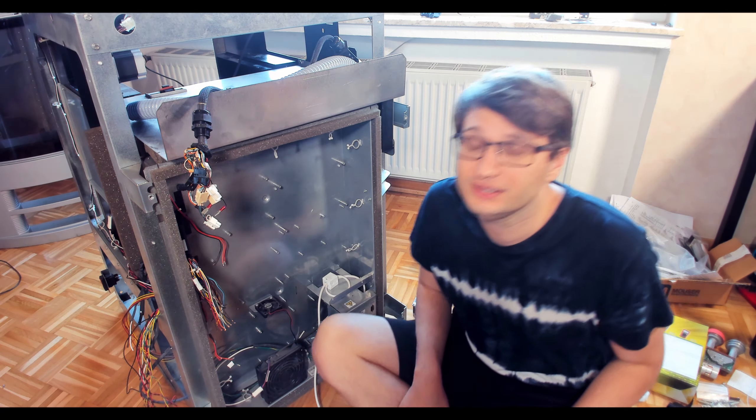The connector kit came with this crimping tool, but the problem is this is clearly not the right tool. Usually with these ribbons of connectors, you would place the connector here on the tool and crimp it without removing it from the ribbon. But this jaw here is too big — if I crimp this way I'm going to be crimping the pin part as well. It should be much narrower.